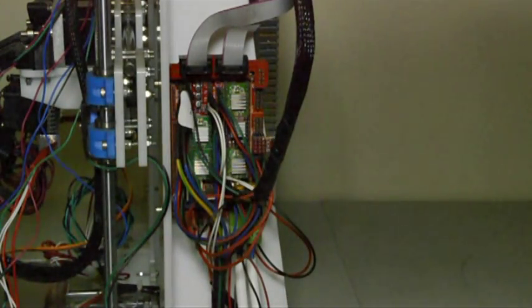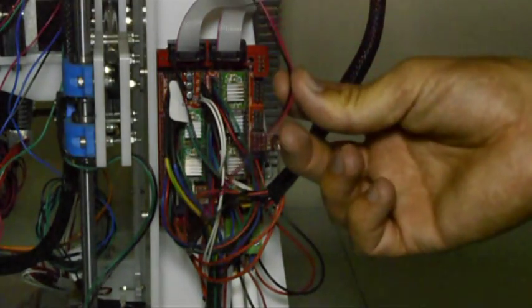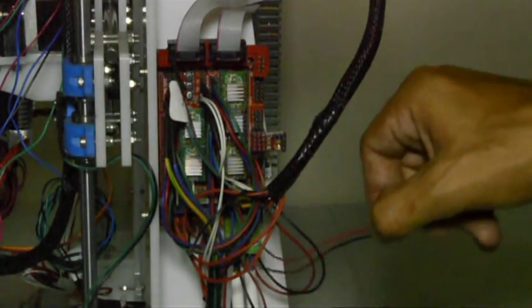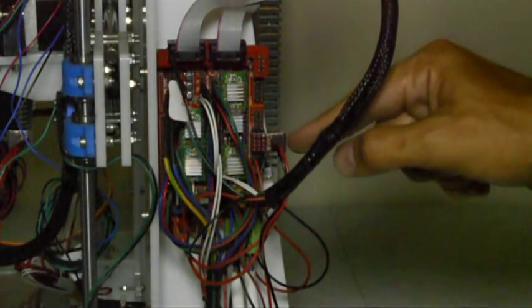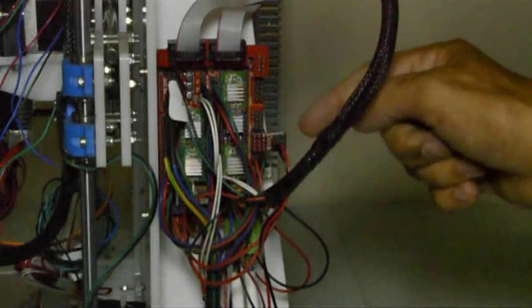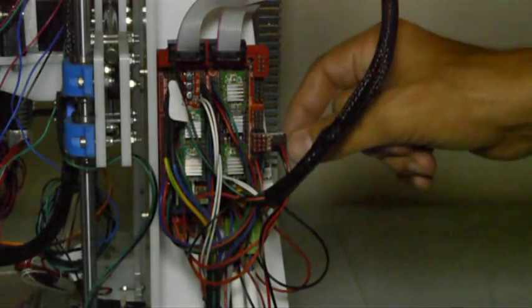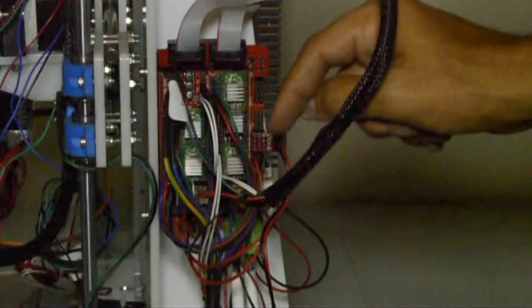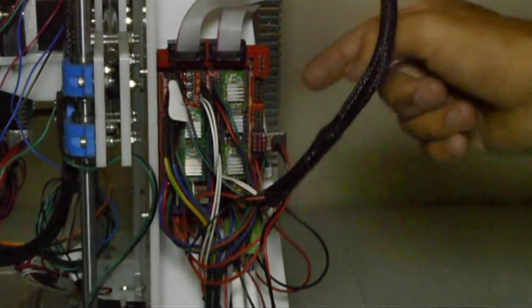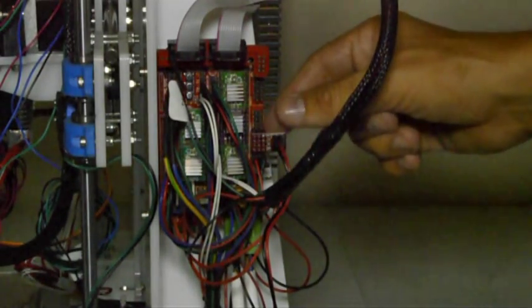Now we will connect the power cable that will supply power to the fan extension module. It's a 200 millimeter two-pin cable. Connect it to any one of the input power ports at the bottom of the RAMPS board. On the top section of the fan extension module you'll see six pins in the shape of an L — those six pins make up three pairs of connections. For the input power, connect the 12 volt supply to the two pins on the top left-hand side: the black wire on the left is ground and the red on the right is positive 12 volt.